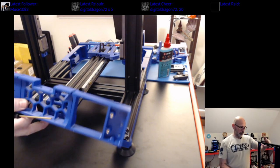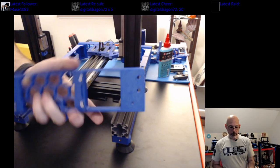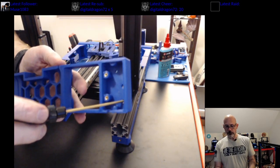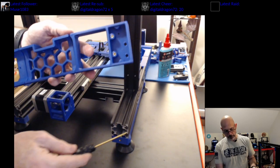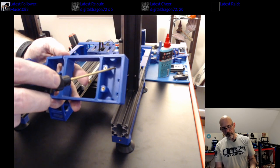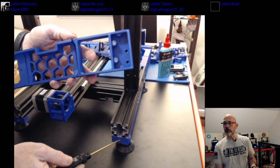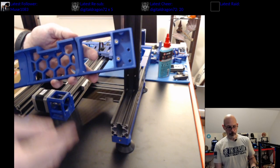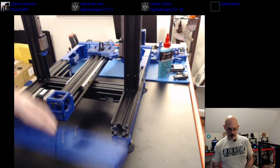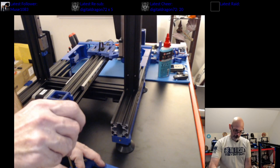Yep. And so another thing to note, you've got your 5mm bolts because it goes directly into the back piece, but these, you also have an M3 screw that'll go down into that extension piece that we've attached, which means that needs to be going this way, which means my center section's on backwards or upside down. So let me flip that over real fast.